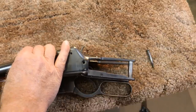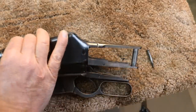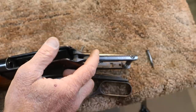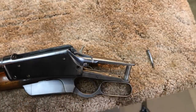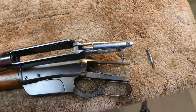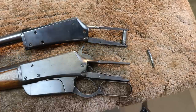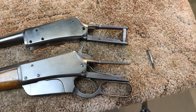So let's see, if we put this right over the top of this one, it looks like we're lined up just beautifully. So I think it's time to get over to the welder and see if we can't get that thing welded up. We got one more thing to do. We're going to have to remove some of this bluing from around where we're going to weld, because any kind of contamination, anything but good clean steel, is going to contaminate that weld. And what happens is we'll get little air bubbles in the weld, and then of course when it solidifies, then we've got what we call porosity, or a porous weld. So we'll get that all cleaned up real good and we'll head over to the welder.